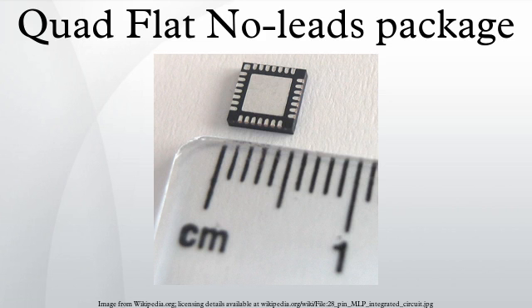Oxidation of the exposed chip contact pads after being exposed to a reflow oven during initial assembly makes solder wetting to them during rework quite difficult. Additionally, there is no clearance for a soldering pencil to reflow pads under the chip if touch up is desired. Sometimes contact can be made up the sides of the DFN package contact pads, but this does not work well in practice.